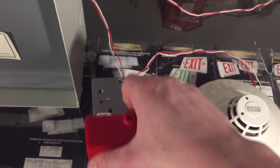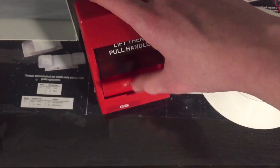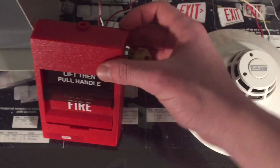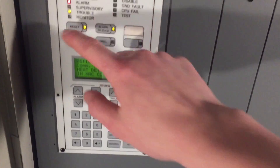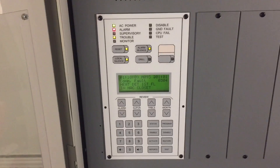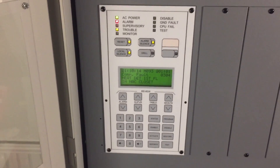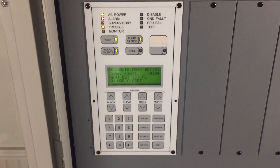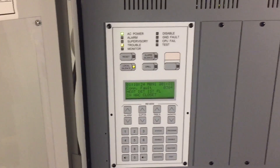Let's reset the pull station and hopefully give time for the smoke detector to clear. Open that up, flip that down, reset the handle, and lock it. Let's press reset. Love that relay click. Resetting is a bit different on this panel — unlike most panels we're used to that do a lamp test and you can hear the piezo beep for a minute, this panel just literally resets the SLCs on the devices. It doesn't do a lamp test, which is interesting.